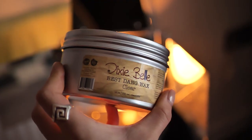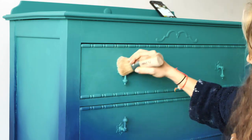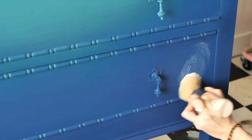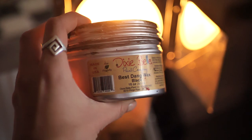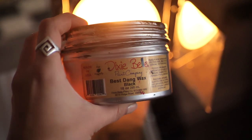Once the paint was dried in about two hours, I applied Clear Wax all over the piece using circular motions, and after 20 minutes I buffed off the excess with a piece of cloth. Next I applied Black Wax — I don't have footage for that — and I applied Clear Wax first so the black one will be easy to move around.